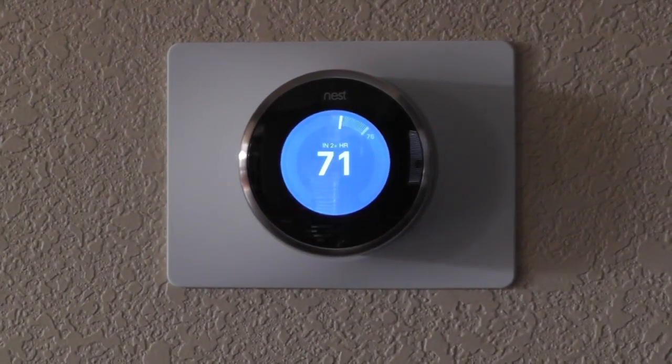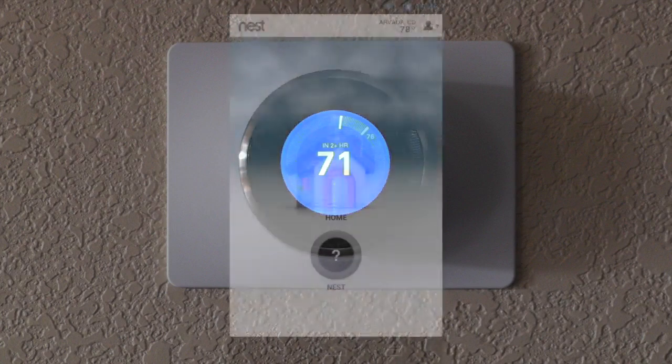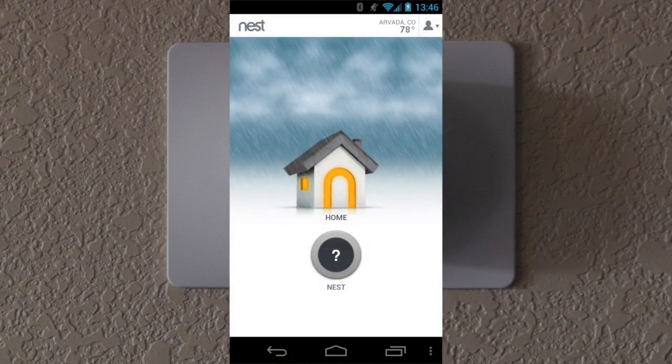Outside of the problem with running the Android app on a tablet, the only other real issue I've had with the Nest is that occasionally I go to the website or the mobile app and it says it can't communicate with my Nest because my Nest has lost its connection to the cloud. The Nest people say it's an issue with some routers where the connection is timing out, but I really don't know. You'd think they would use keep-alives or something, because my IM client works just fine and other programs that use persistent connections work just fine without constantly timing out. But depending on your router, you may occasionally get this message with a question mark in front of your thermostat, meaning it's lost connection. Usually if I just wait a minute or two, it'll come back.